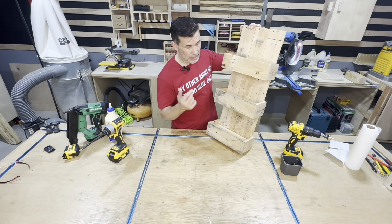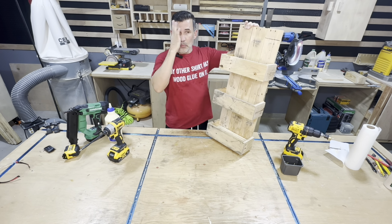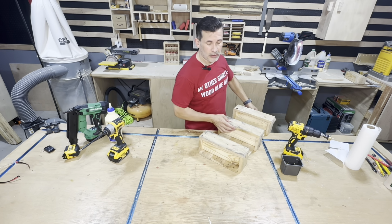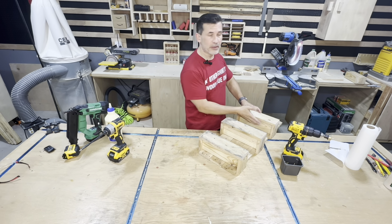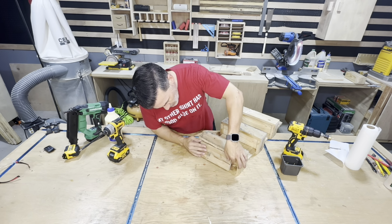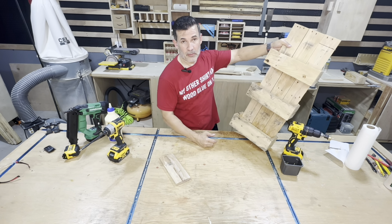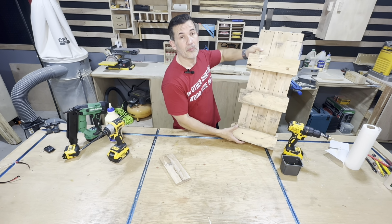That's it. Extremely rustic shelf made from pallet wood. Now, depending on how high you are mounting this up on your wall, if you see up into these cavities and you don't like the look of it, cut yourself an extra piece of pallet wood, tack it to the bottom. I don't have an exact size, but if you were to put this in here, if you're worried about seeing it, it's going to cover up that 2x4 on the bottom. This is not going to be seen from the eye level we're mounting it, so I'm not too concerned about the 2x4 being seen underneath.